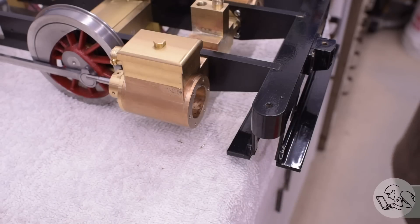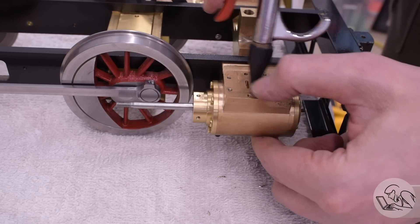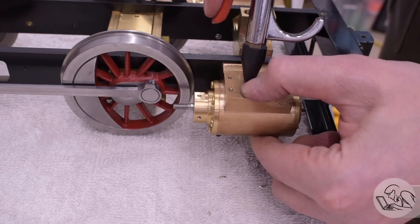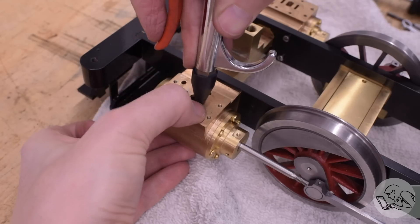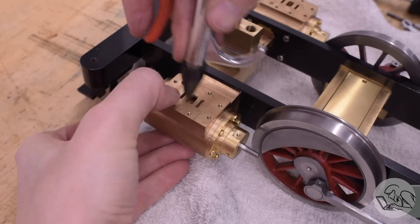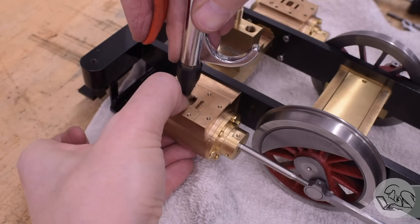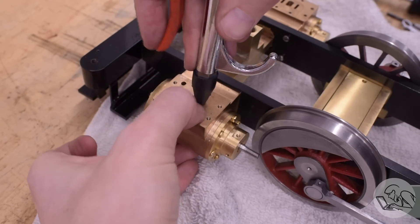Let's do a little test with some air and see what happens. This is kind of like first signs of life from this engine — we've made a teeny, adorable little air hammer. The efficiency of this is basically a function of how good a seal I can make on the other half of the port with my thumb, hence the variation in the speed of the rods, but I'm really happy with that motion. They seem to be working really well. This is 20 psi, which is more than should be necessary for moving the pistons, but because there's no seals or gaskets and I'm trying to cover the port with my thumb, 20 psi is working well.